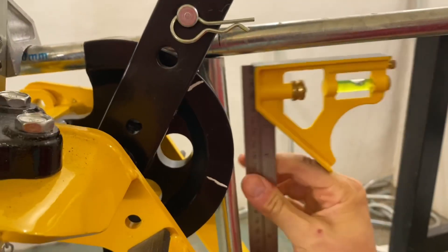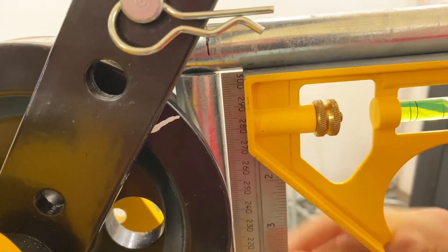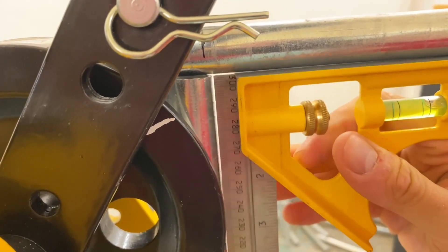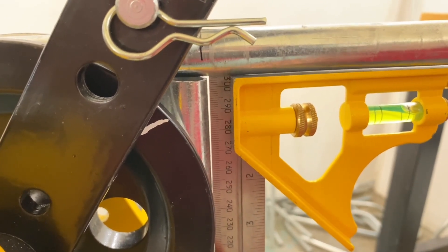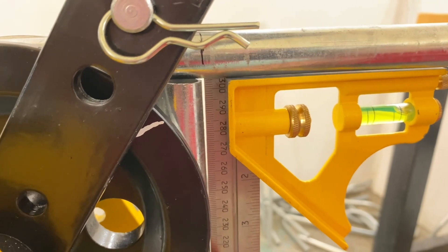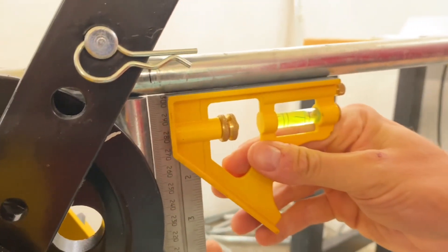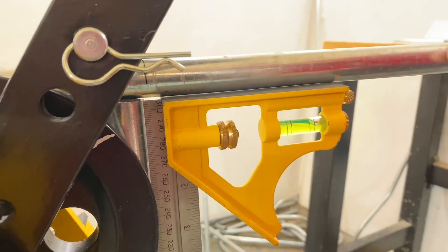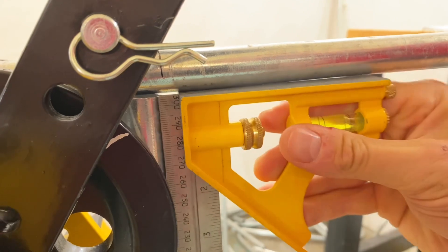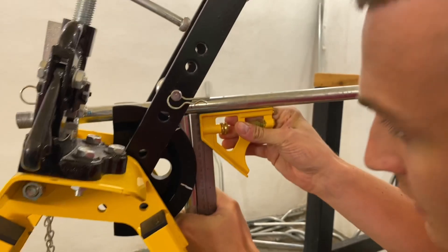It's important we get this line in the right place as we saw previously — the 200mm mark obviously goes into the conduit bending machine. Effectively we're bending the waist. That's right, so scrap piece of conduit in, set square against it so we're at the same angle as the conduit. That's probably a fraction in, so you're going to just pull that back out so that line lines up with the back of the conduit. We're going a fraction further. Are you happy with that? Yep. Okay, so that's going to be your first bend.